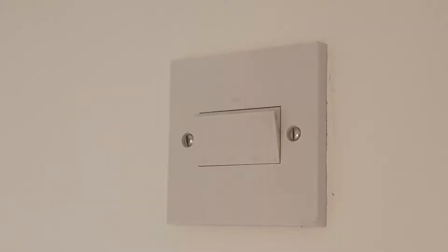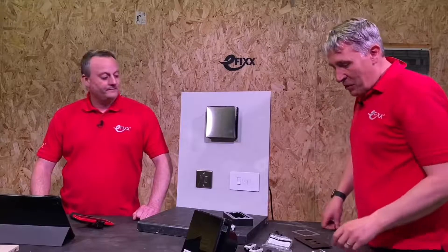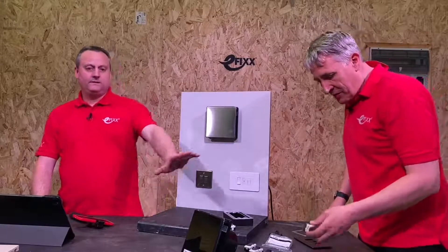I think of that really large switch above the door pretending it's not there, but actually really large and probably visible from the bedroom if it's an ensuite. I'm not a big fan of those, and then the next problem - you're in an environment where you want decorative finishes, can you get the colour you want? Probably not. What about the fusing option? Well it depends on the manufacturer's instructions. Knightsbridge have solved all of these problems with an addition to the grid switch range.